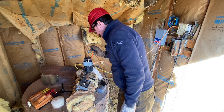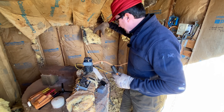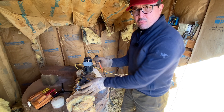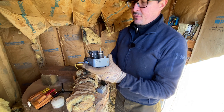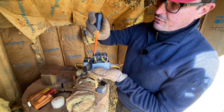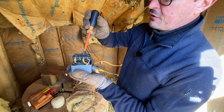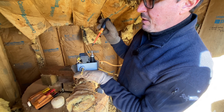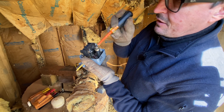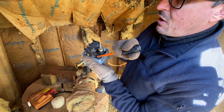I've poked around here a bit and I found out that we do have power. So how it works is that we have a shallow well, we have a well pump in a casing right here, and that is fed by this wire. This is actually a pressure switch. You bring 240 mostly into your well pump - there's a 120 circuit here and a 120 circuit here - and that feeds this switch and then this goes to the controller to the pump. This spring right here - you can see the switch right there - this is what turns the pump on. When these little contacts are out, the pump is off; when they go on, that turns the pump on.